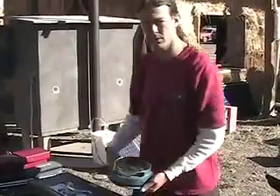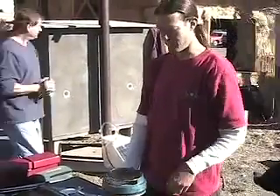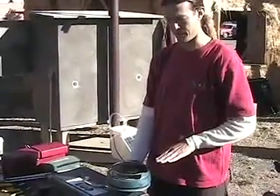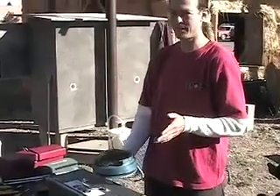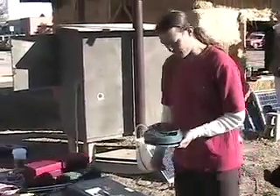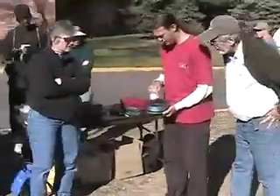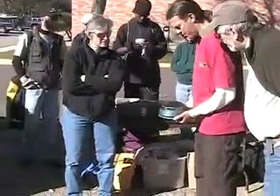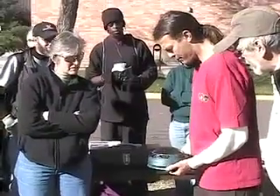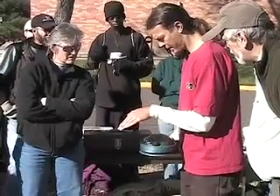To read this, we want to be standing directly over top of the unit — not from the side or the front. It actually works best on a somewhat overcast and cloudy day because we don't get the big sunspot glare, which we'd have to cover up with our hand. On an overcast day it works a little better because you don't have to deal with that glare, but you can still block it out with your hand. Basically what we do is get set up facing true south — compass needle pointing south — and get the bubble level centered in that little black concentric circle.